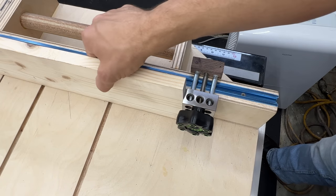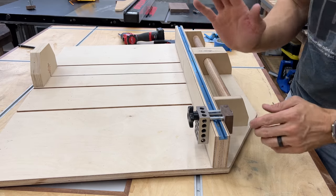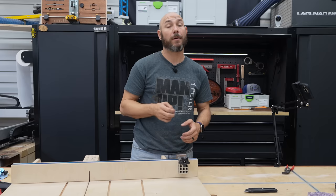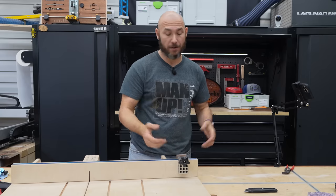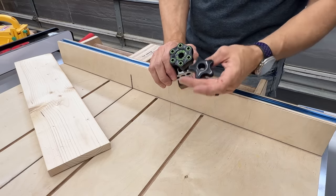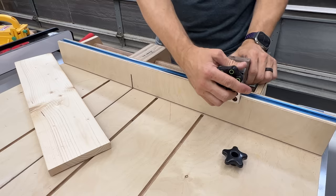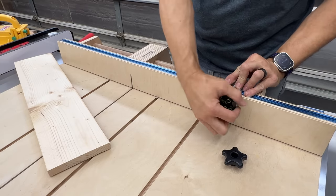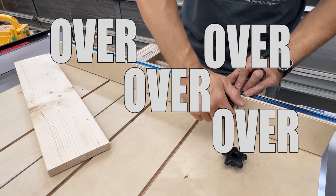That 5-degree angle we put on there earlier helps pull that thing over a little bit, gives it a little more leverage, and that'll clamp it down really tight. The previous version I made didn't have that, and it still clamped fine. This also works with the bow featherboard knobs or a 5/16 jig knob. Super simple to install. All you do is drop it on your fence and then tighten it down wherever you want it, and then you can make those repeated cuts over and over again.